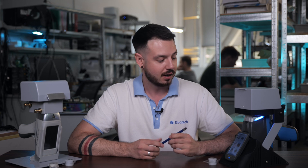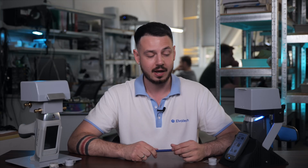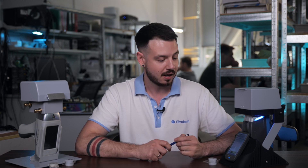Let's move to the most interesting and practical part of our video. We have already started the device and have the calibration menu here. All we need to do is select the right calibration. Our first sample is ferro-titanium, so we select ferro-titanium in the menu and start the analysis. We selected five seconds for analysis. For a deeper analysis you can use 10 to 20 seconds, but for fast screening to show approximate results, five seconds is sufficient.